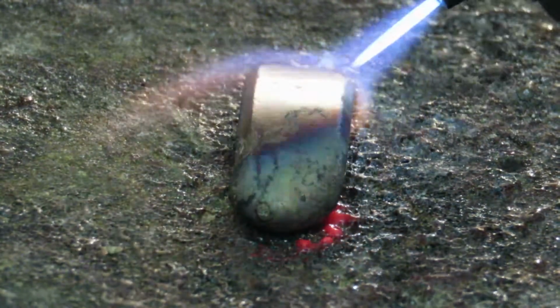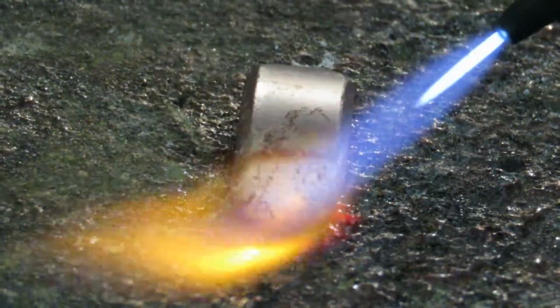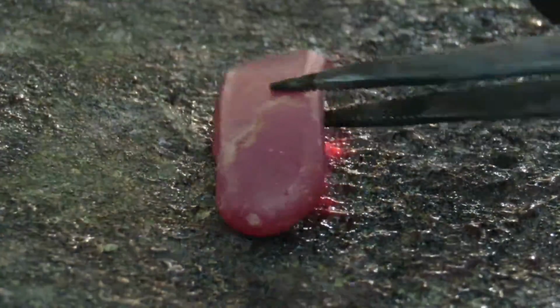As one rolls the metal, it hardens. The annealing process realigns the atomic structure of the metal, softening it up and making it possible to further work on your metal without your metal shearing, cracking or splitting.